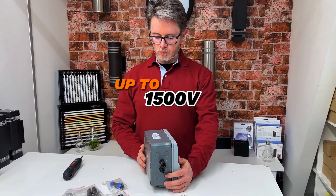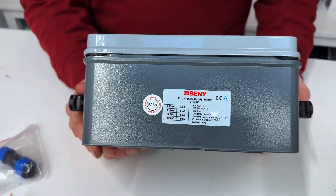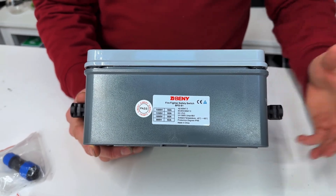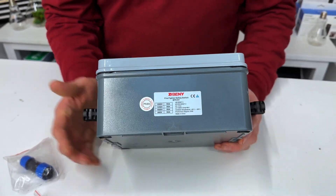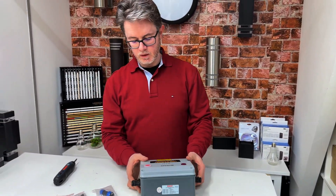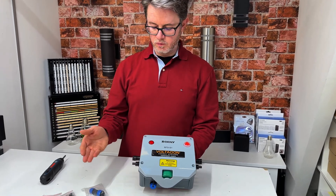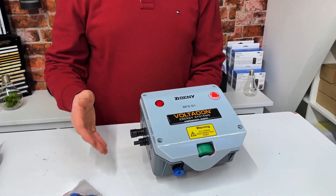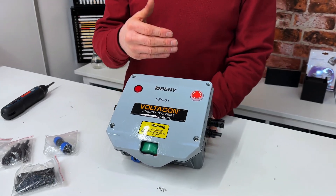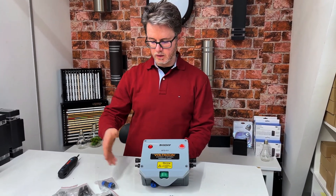The rating is up to 1500 volts. It can be any amperage from 10 amps to 50 amps and from 100 volts up to 1500 volts. This box is for a single string — one comes in, one goes out. You can have multiple strings in the same box, from one up to four, and if you need more than four you can connect these boxes in parallel.